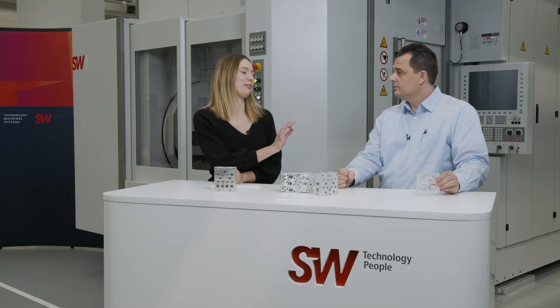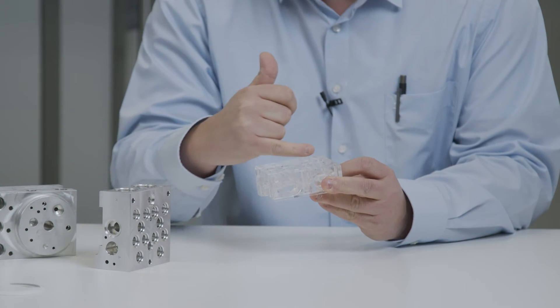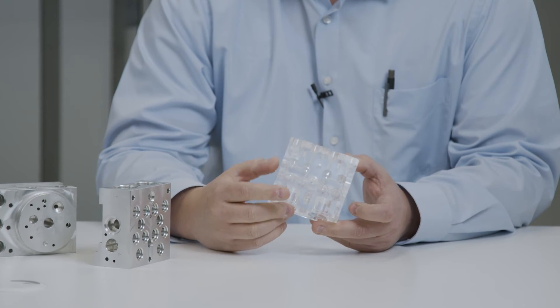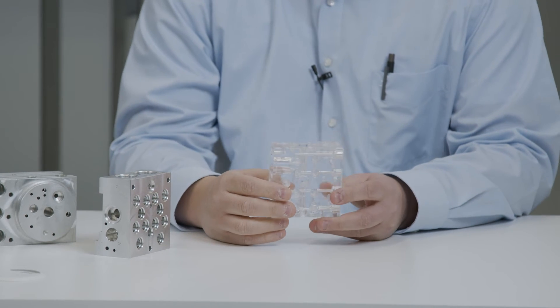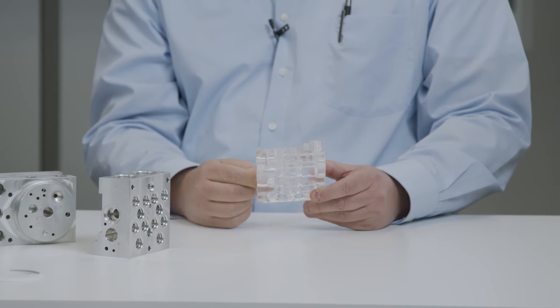There is something specific about the second operation that we are quite proud of, because we are the only ones doing this. With four spindles simultaneously, it's a deburring process done with a milling ball tool. As you can see in a close-up of the part, the tool — which is 2.5 millimeters in diameter, or even less depending on the product — goes into the part and rides along the contour of the intersections. These intersections usually cause burrs which could negatively affect the ABS housing, so we did a lot of development to deburr approximately 90 percent of all intersections.